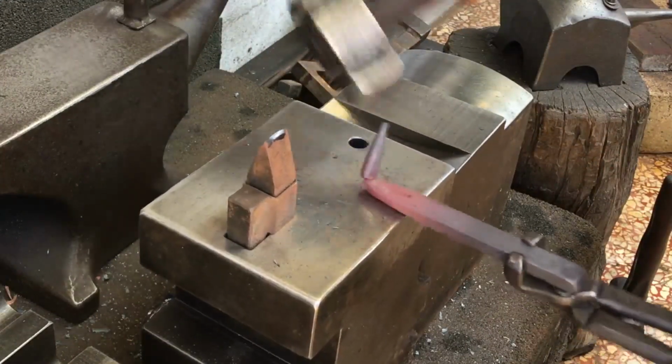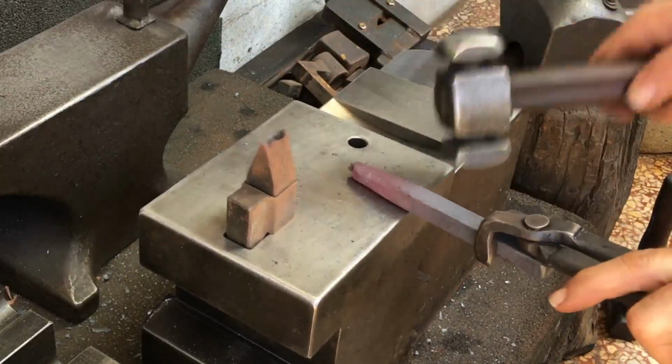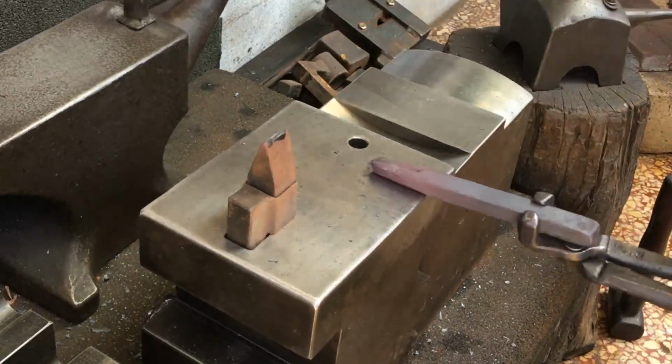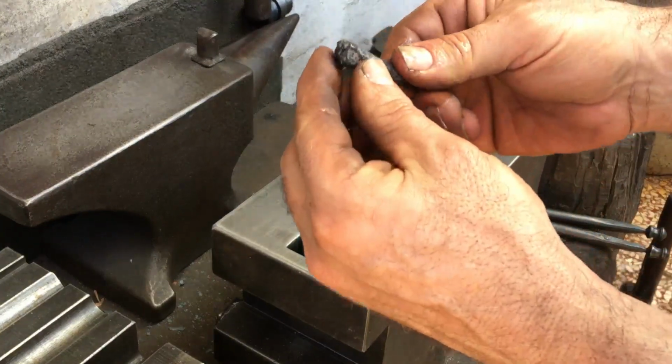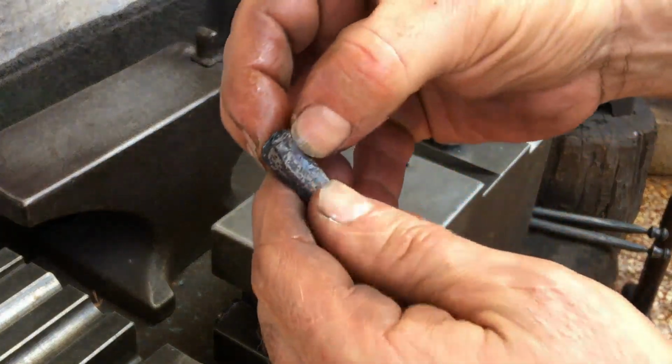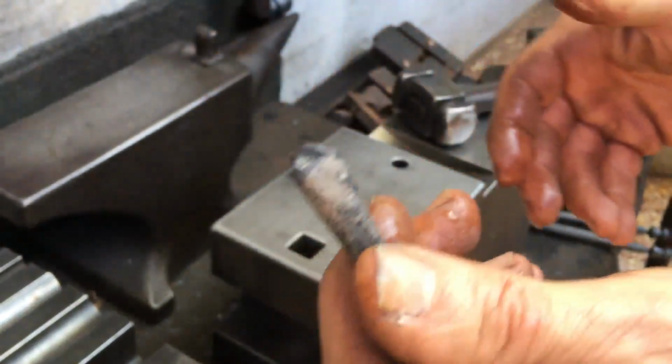This YK30 steel is very hard at almost 1% carbon, and so I think I'm going to rework it and then leave it in a normalized state. Another thing I should do is hold off quenching right away between heats. Wait until the business end is just a little bit cooler than how I was normally doing it.